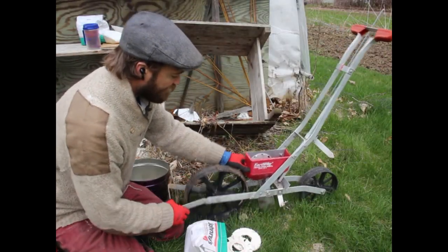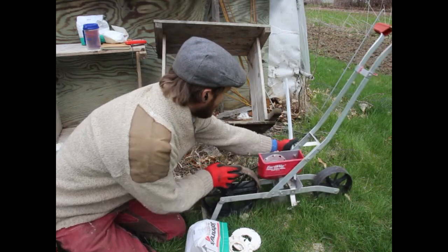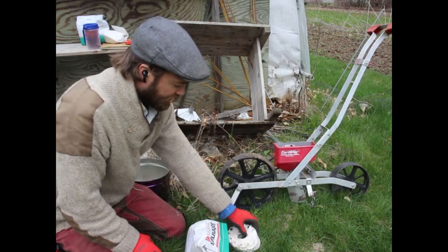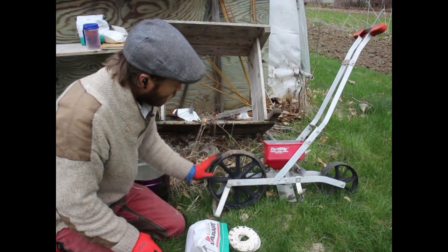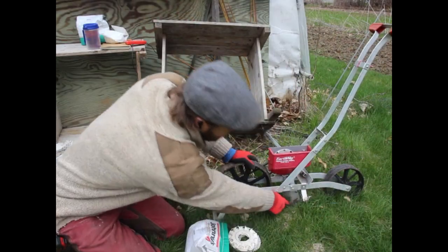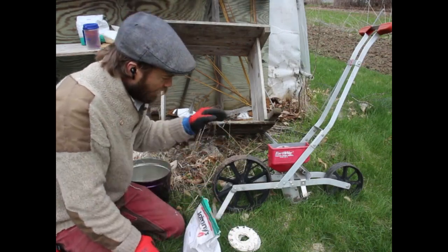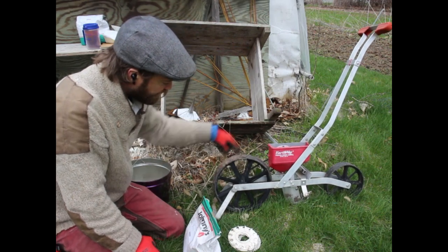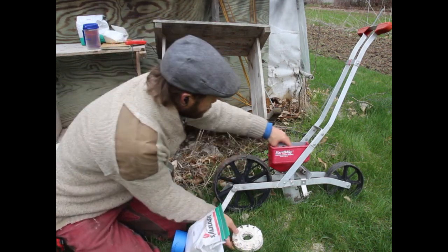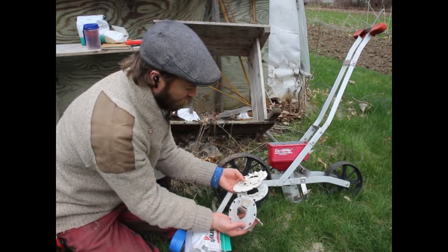Let's talk seeders. I don't have a big seeder that goes behind a tractor with 20, 40, or 60 drills. I have this walk-behind garden seeder, which is not designed for grain, so I have to modify it slightly. Basically what happens is it turns a wheel as you walk, a disc in here turns and pulls up seeds and dumps them out down the chute into this drill that's plowing its way through the soil. I need to drop about 10 seeds for each foot, and one revolution of this wheel is three feet, so I need to find a disc that will pick up and drop 30 kernels per rotation.